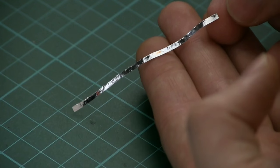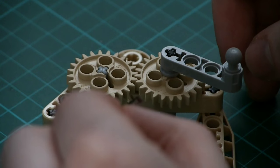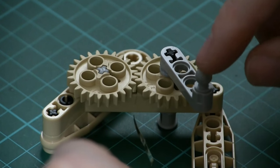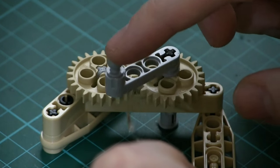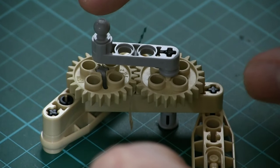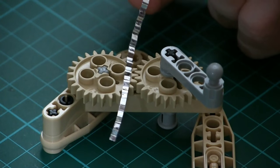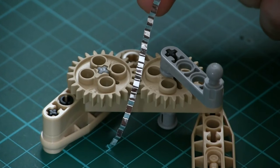The new ribbon is longer than it needs to be, but we're going to lose some length during corrugation. Corrugating the ribbon will allow it to be held under tension, while still being elastic enough to move freely — an exceptionally important thing for a ribbon microphone to be able to do. For this, I'm going to run the foil between two plastic gears. My first attempt, I'm going to use this little jig that I've made out of Lego, although I suspect I could probably get better results from gears with a higher density of shallower teeth.